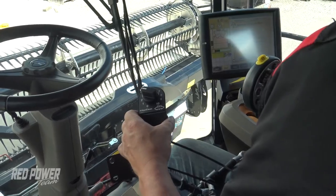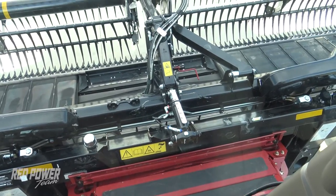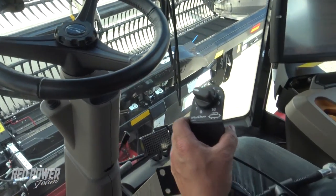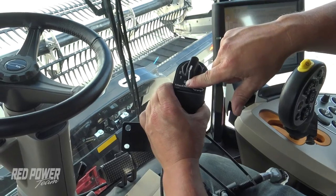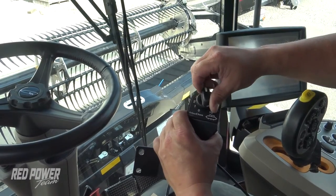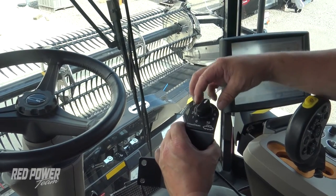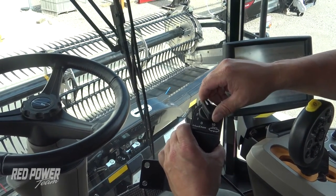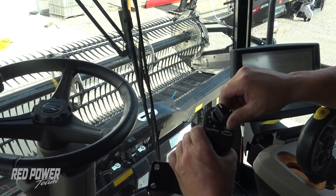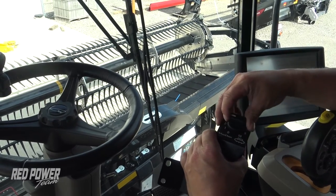I'm going to roll my head back so I can see my draper belt easier. I'm going to start up my separator and feeder. Running wide open, if I spin this down to zero, you can see my side belts have stopped. And if I spin this clear up to ten, our belts are running pretty fast. As I keep adjusting in between, our side drapers are slowing down as I keep going down. Most of the time we're running that three to four setting for doing beans out in the field — so that's our good starting point. We just function tested this and everything seems to be working good.